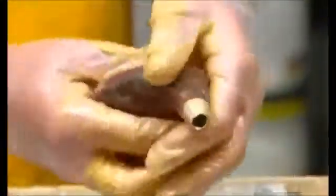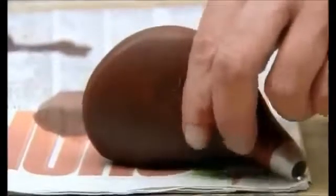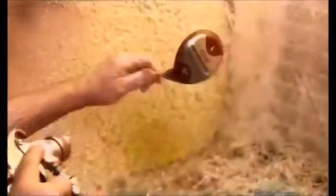Then, things get messy as they rub a pasty substance all over the golf club head, plugging the open pores of the persimmon wood. It's a crucial step that will allow them to achieve a mirror finish later. They number it to identify it as a fairway club. And then they give the sole plate a good scrubbing with steel wool to get rid of any fingerprints.